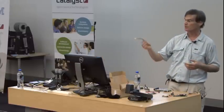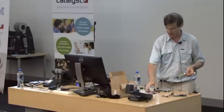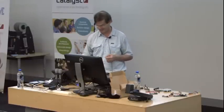In the future, UAVCAN is going to be replacing a lot of that. We have our first CAN bus electronic speed controller relying on UAVCAN and the CAN bus support in Linux, which is great, and on other platforms. And there's a CAN bus GPS and barometer and compass, a bit big, but yeah, CAN bus is great stuff. You'll be seeing a lot more of it, I think. All right, Al, you don't like CAN bus? Bit tortured by it, okay. Well, I love it. If you see uavcan.org and Pavel's work on that, absolutely brilliant. He does a lovely abstraction, portable to lots of different operating systems. We just take advantage of Pavel's work.